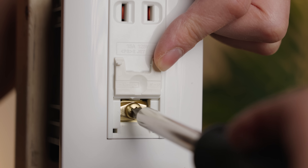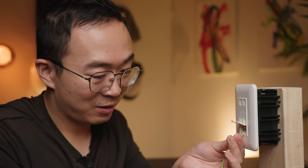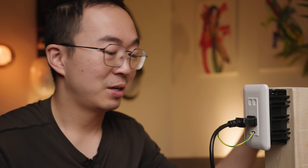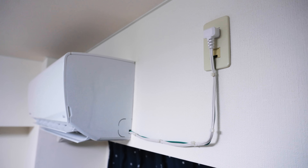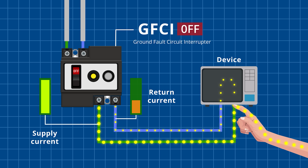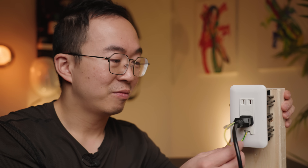But what do we still need grounded outlets in Japan for? You would get shocked before the GFCI activates — up to 30 milliamps — which can injure or kill small children, and if you have heart problems, good luck. Ground replaces your body and automatically sends the electricity away, tripping the GFCI for you. This Japanese grounded outlet looks regular from the front, but underneath there's a special screw terminal connection for a ground wire. These are rare — as a tourist you'd only see one behind a washing machine or air conditioner.